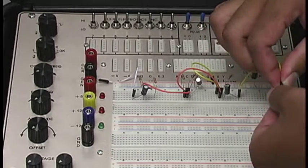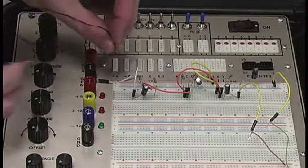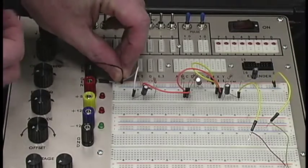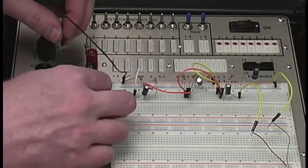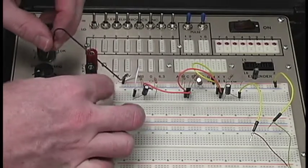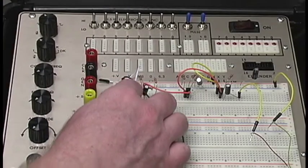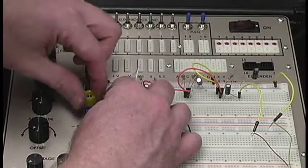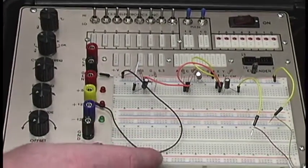And so now we have our last two connections right here, which is going to be our power connection, which we are going to connect to our little V plus right here, where we have our constant 12-volt source. And again, we're going to put that through the little shaft for the screw, that's what it's there for.